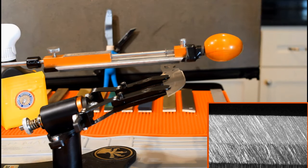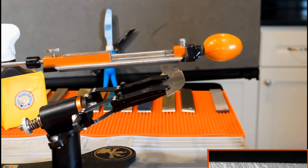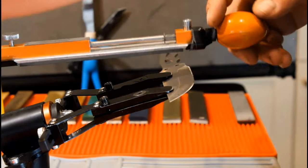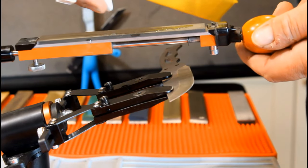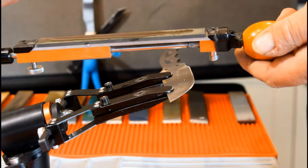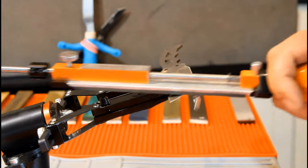As a beginner, you may not have placed the stone in the clamping block properly, or placed the angle cube askew. Checking this with each stone is good practice, and it will save you a lot of wasted time if you catch a small mistake now. If the stone is rubbing the bevel evenly, you will see the scratch pattern has changed considerably.